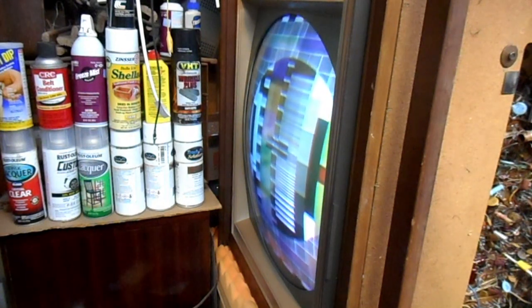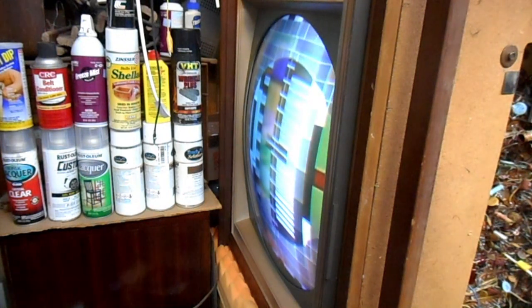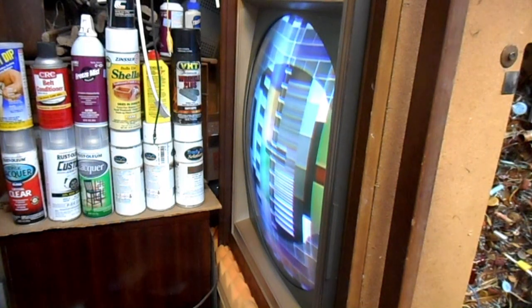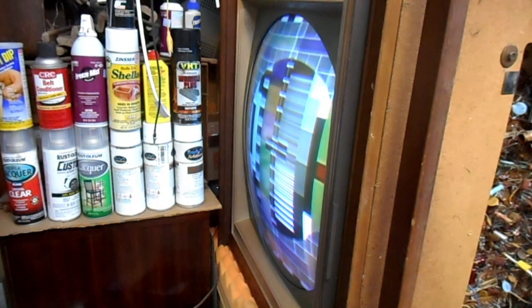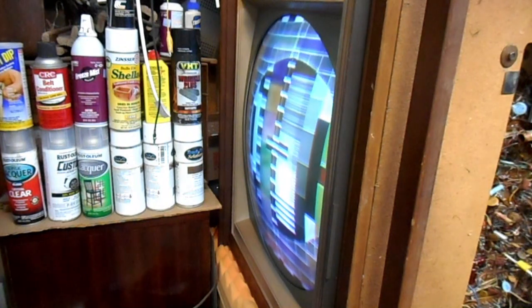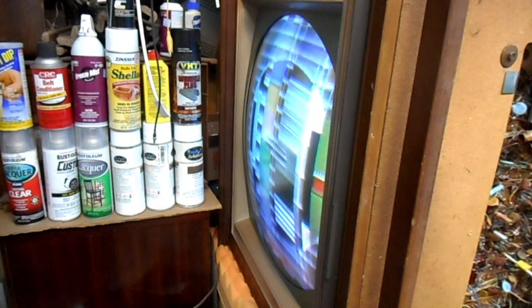Some of those hum effects are actually caused by ghosting down here in the basement. There's basically posts that support the central girder of the house, and those will create ghosts and RF echoes and other weird phenomena that create weird RF symptoms. Move the antenna around and change behavior.